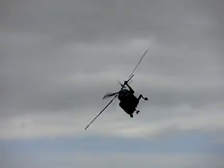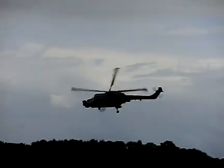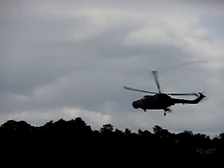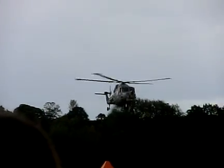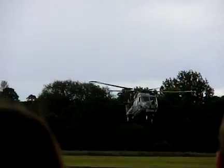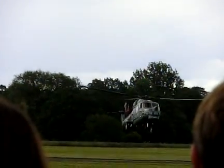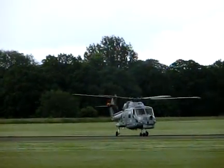It's on his little wheels, John, as you so succinctly describe, a very important part of the Lynx aircraft. The Royal Navy operates the Lynx on the backs of frigates and destroyers, a very, very small flight deck. And if the ship can't manoeuvre into the wind for various tactical reasons, what we can do is spin the aircraft on the spot so it can point into the wind to take off. So that's the important feature that you're about to be demonstrating now. Castering, I believe. Castering indeed.